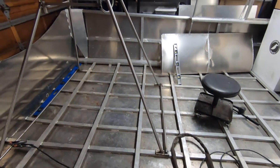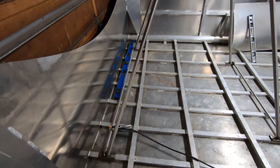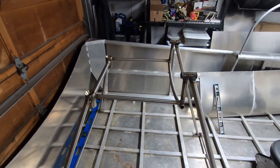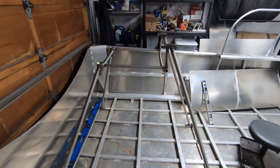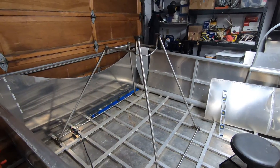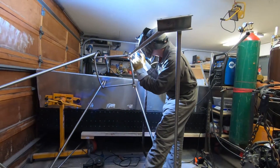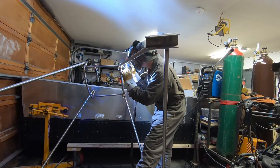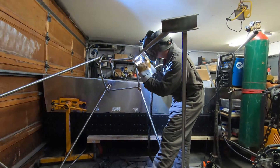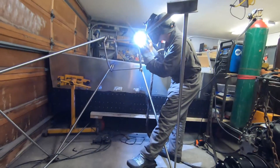With the main supports coming together, everything is measured multiple times to be as square and as level as possible. With all the supports removed, this is the basic structure of the engine mounts. What will be next is making quite a lot of cross braces, gussets, and supports to make it as strong as possible — it has to support the weight of the engine and gearbox along with the thrust of 400 to 500 horsepower. I took it out of the boat for some finished welding to complete the beads, and then I'll put it back in and fabricate the new cross braces, all coming up in the next video.